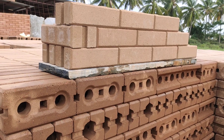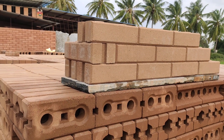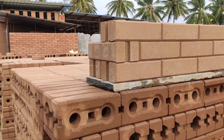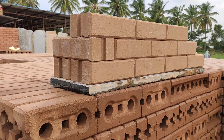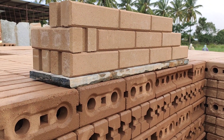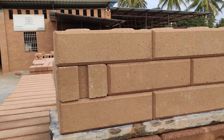Sizes of doors and windows can also be in multiples of 150 — say for example a 3-brick sized window, a 3-brick sized door, a 4-brick size, or 3 and a half will also do. 150mm is half a brick. So those are the basic guidelines of building with the interlocking bricks. Please do visit us at www.earthblocks.in.